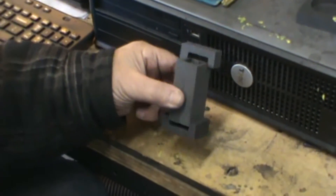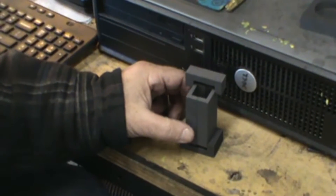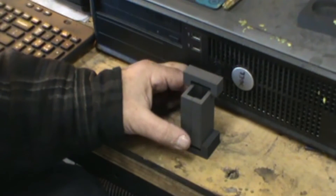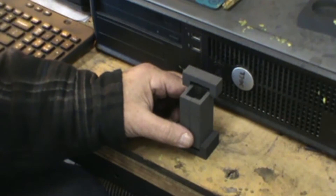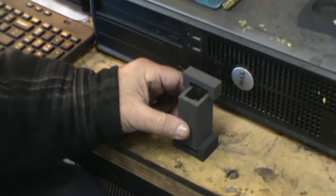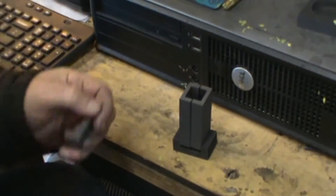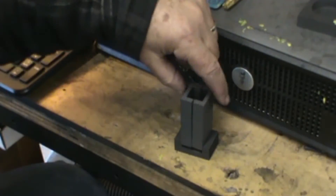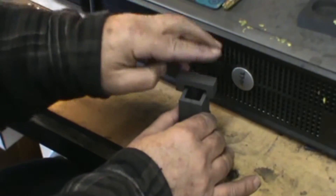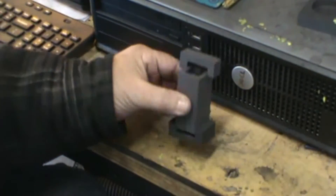I made them small because these fit the Micro Mini just really nicely. These are the same width as the standard gravity mold, but the standard gravity molds are an inch taller where you'd need to use an expansion ring. That's how you set this up — it just does not take much force. It gapped open a little bit right there, no big deal. You just put that on there. That's it, it's ready to go.